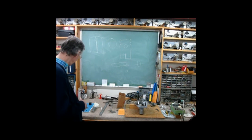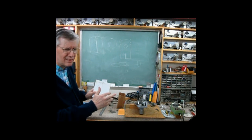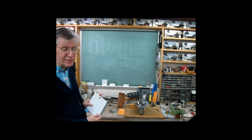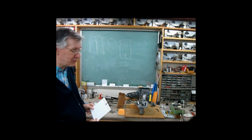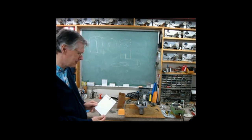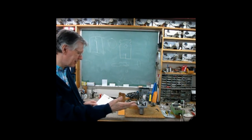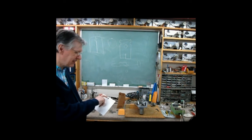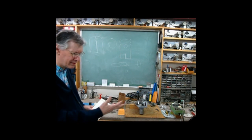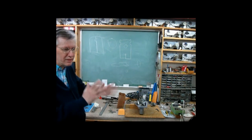We had the problem with the winding, turns ratio versus the level, the signal level, or gain, if you want to think of it that way, which is probably not an accurate way to think of it, but we had an abundance of that, and so even at the longer tip lengths, we still had more signal than we needed to be within operating range.